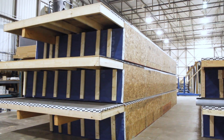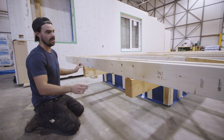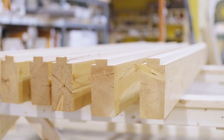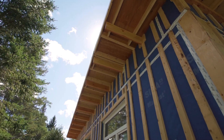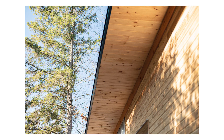On this project we're doing decorative rafter details. We're using BC fir and we did a slight rabbet, which is the thickness of our soffit. Once these are landed and all in place, they're then ready to slide in all of our tongue and groove, which will make up the soffit on site.